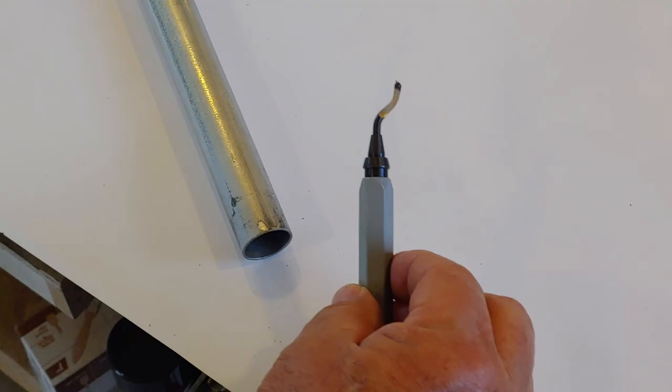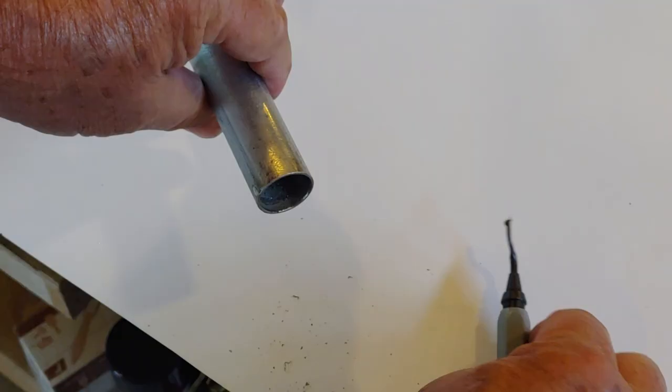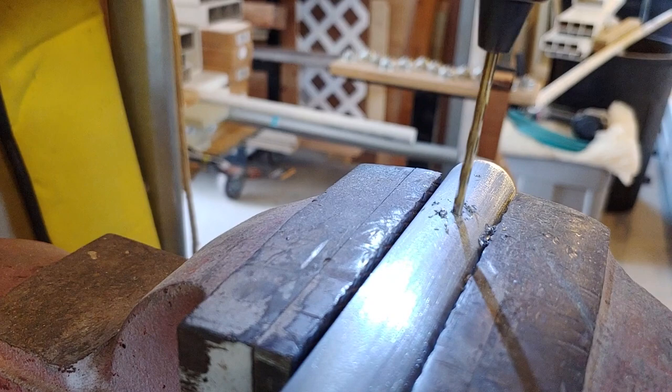The first thing you need to do is deburr the conduit. There are little sharp shards or filings that can really cut up your fingers or make it hard to insert the flag topper. Go ahead and deburr using either the deburring tool or the rat tail file. Once that's done, drill a couple of small holes at the end where the flag topper is going to be, if you're using one with a tenon — which we did, repurposing the old one we had.